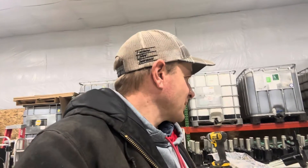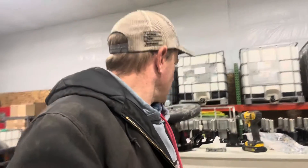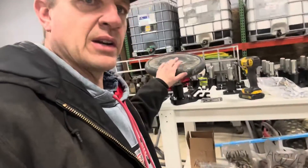So I think it'll be fine going forward. We really love that drill other than this hiccup. But if any of you guys have a Case 500 disc drill, especially if it sits out over the winter, I would check and make sure that those closing wheels pick up and down freely and that they spring back. We had a little bit of emergence trouble last year - you could see in certain rows where I think these were starting to hang up. So you might want to check that out.